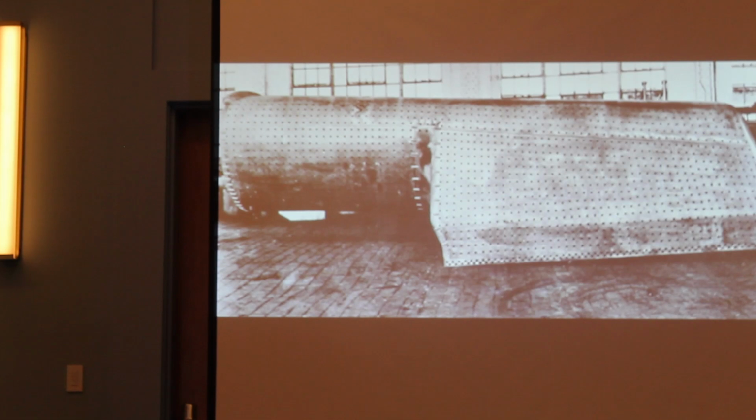All the welds and heat affected zones, they go away because everything is cooled down slowly. When you put weld metal in, if you've ever seen it, it goes from white hot to dark fairly quickly. So it's freezing very quickly, which creates stress on it before you even put pressure on the boiler. Welding eventually became the preferred practice after they figured a lot of these difficulties out. Now we take it for granted, but it's like anything else. Live and learn. You learn the hard way, and many times it's not very pleasant.